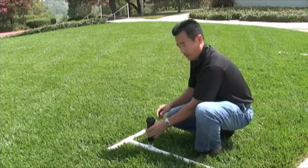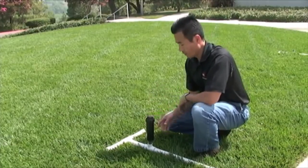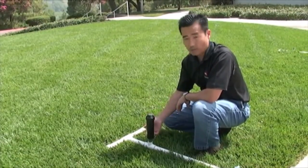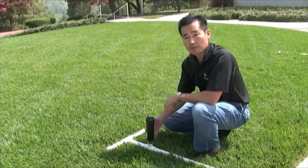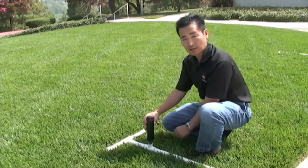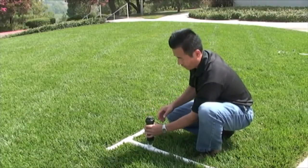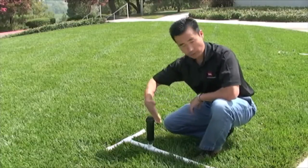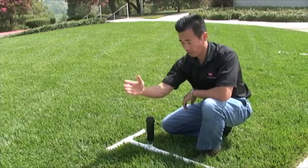And this only needs to be hand tight. There's no need to really use a wrench or anything like that. Threads below are pipe threads, therefore they're tapered, and it will seal on its own if you just give it your hand tight torque. But let's say that it turns out your left stop, for example, is pointing back here, whereas we want it to point here.